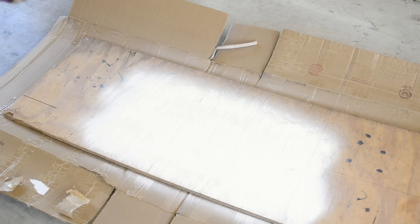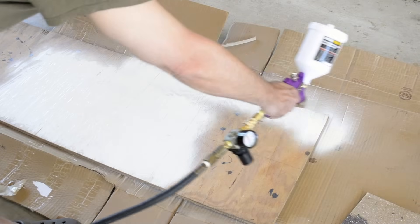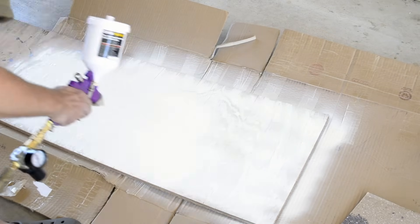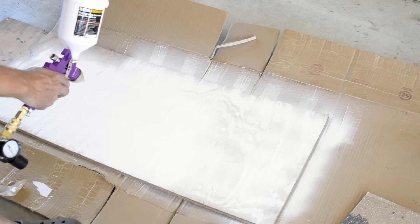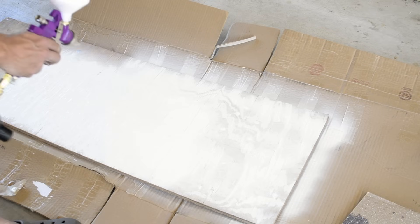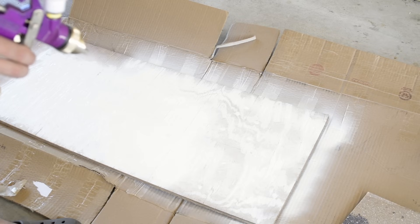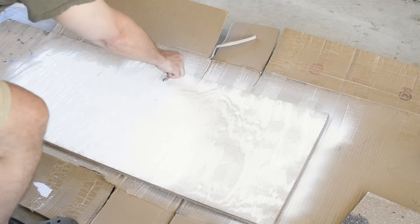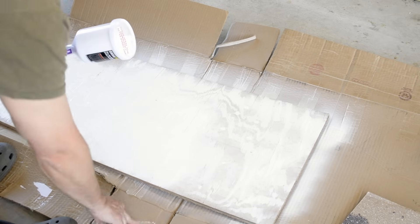This is probably a better rate for something like primer, considering how thick this paint is — this is even thicker than primer. So that size hole — remember I drilled that out to 5/64 — would probably spray primer or maybe even a thinner latex perfectly. That's as wide open as this gun will go.